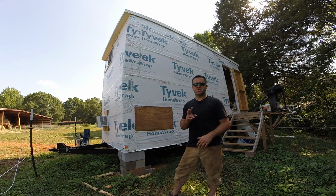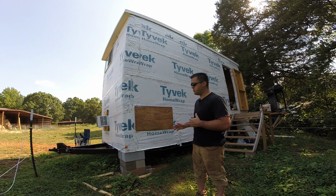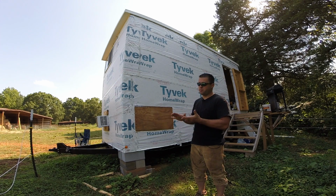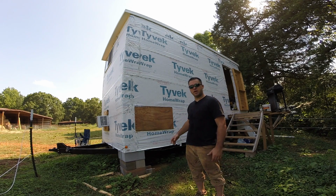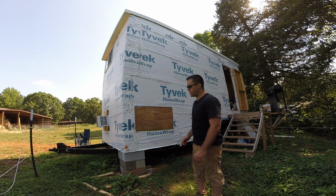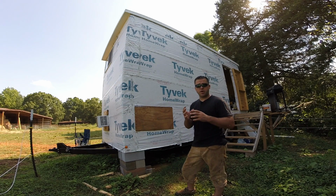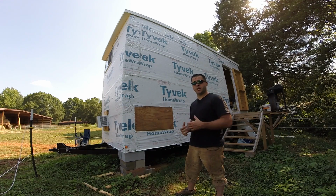I'm Dan, and in this one-part video series, I'm going to really try to make it one. In this video, I'm going to be hooking up my undercarriage plumbing. Since tiny houses ride really low to the ground, any plumbing that I install on the bottom is going to be hanging down. If I were to drive out of here, it's going to drag on the bottom and crack all the plumbing. So I'm going to install all removable plumbing, made in a way so that I can break it down into multiple pieces and put them into the tiny house when I'm moving.